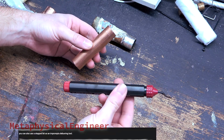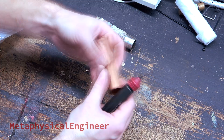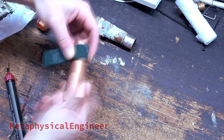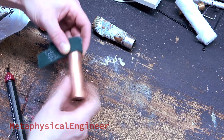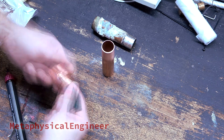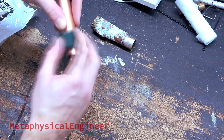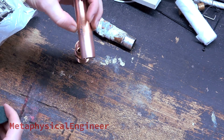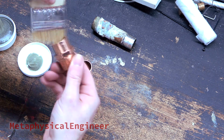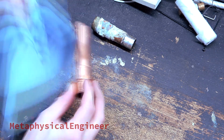Hey, look at that — I did in fact get a new deburring tool after the long endurance UPS project. I'm actually quite comfortable with brazing, but I've limited experience with soft solder. The key to both is in the preparation, though brazing can be more forgiving. An abrasive pad scrubs oxidation and other contaminants from the surface and slightly roughens it for better solder adhesion. Flux paste applied to both surfaces of the joint will scavenge oxidation as the joint heats up and promote good wetting behavior of the molten solder. Flux is corrosive, so avoid getting any on yourself and wipe excess away once joints are assembled.